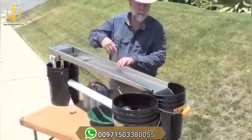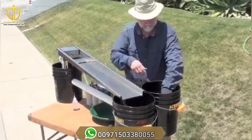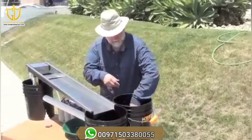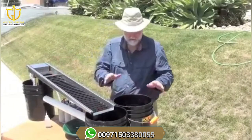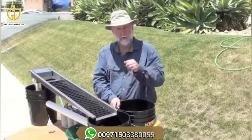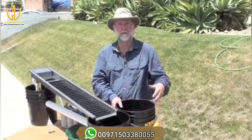At this point we've got the mat and all of the gold into our bucket. Put the hose nozzle away, turn the pump valve back on, and get some water in on top of the mat to make it easier to clean up. At that point, shut it down. Shake the mat up, check it for gold, and put it away. Now you've got your bucket of concentrates, and from there we're going to get it into a pan and pan the last of it out. That last cup of material — I get all the gold I can out of it, then I take that last cup and put it as a primer for my next run, so I'm not using chemicals or anything else in the process.